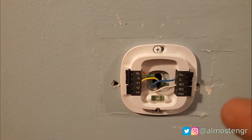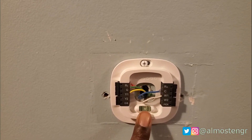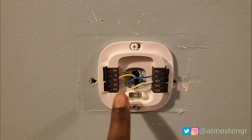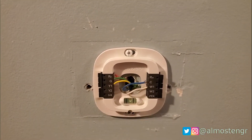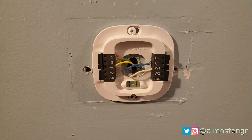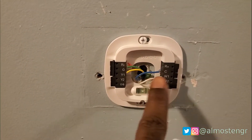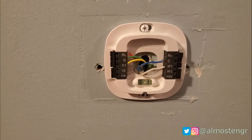Once you have everything out of the box, this is the mounting plate that comes with the Ecobee. It has a level built into it down here, so be sure to level out your thermostat. When you take off your old thermostat, take a picture of the wiring diagram — how it's wired up. Sometimes the wires do not match their letters, so I'd suggest taking a picture with your phone before you remove the wires. When you go to reconnect for the Ecobee, as you see mine, the letter and the wire color correspond to each other, so there's no issue there.